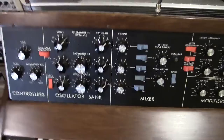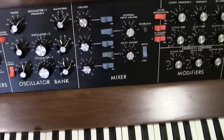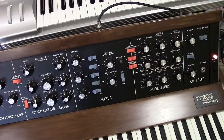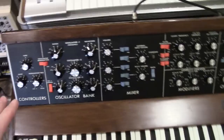It took me a little while to figure this out. What I ended up finding is it wasn't in his boards, which is kind of odd. I was looking at his boards, looking at power, all these things. But I finally figured out that the clue was the sense line — the voltage sense line for the power supply — the actual harness was bad. I've seen this in some Moog synthesizers from around 1977 to 1979. Evidently Moog had bought some wire that had some kind of contamination in the actual core, and it would cause the wire to corrode from the inside out.